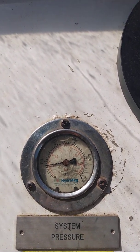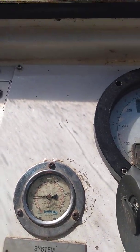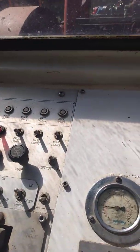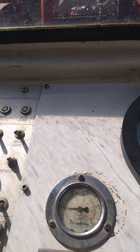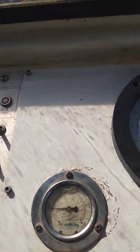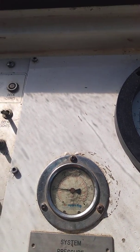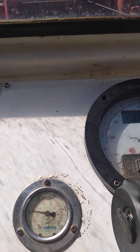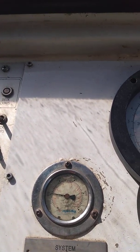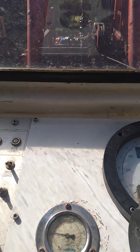There he is — that's a tag right there. I'm going to call that 6,700 feet. With this rig, since the line is just a quarter inch, I usually start off only pulling about a thousand feet just to see how much system pressure I have when I'm coming out. But it's different — it just depends on if you're getting oil, fluids, or whatever. It also depends on how deep you are. This well here is only 7,500 feet as far as I can go — 7,550 is the X nipple.